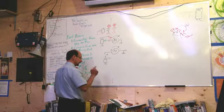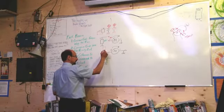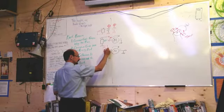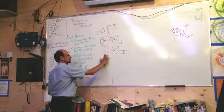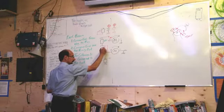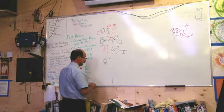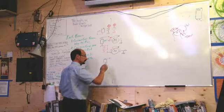To make it turn counterclockwise, we're going to take another battery. You can see this is positive and this is negative. I'm going to put the positive to ground, and take the negative and put it to a switch. When I close that switch, if this is 12 volts, I'm going to get negative 12 volts relative to 0 volts. This is now negative voltage, and that terminal becomes positive with respect to it. It will now turn in the other direction — counterclockwise. We've made it reverse.